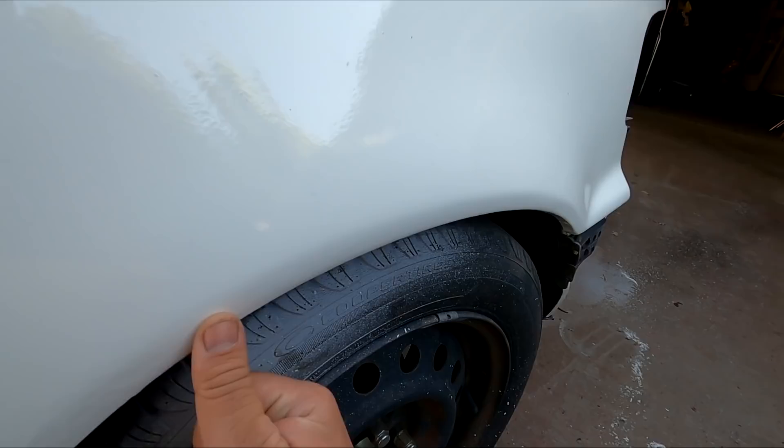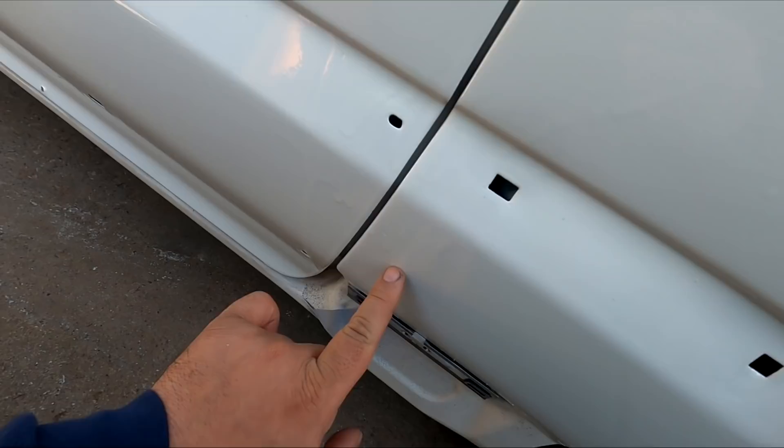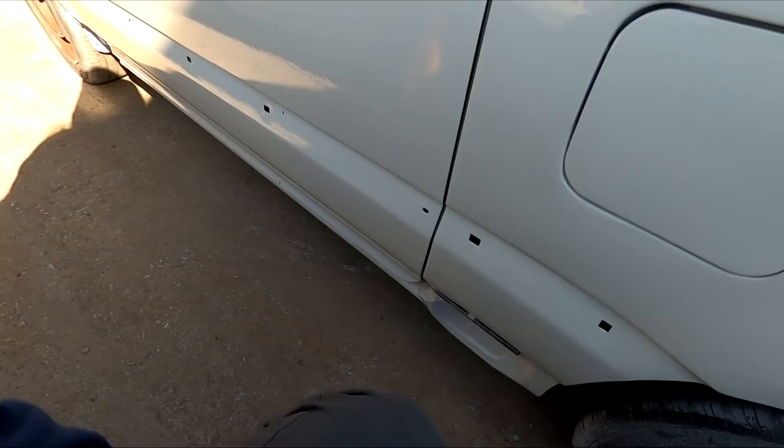But nonetheless, this can be blocked out no problem. Just got to stay away from the edge. We have a little bit right here still. And a new one that I saw just now is this clear coat run right there. These little two drips right here. It's smooth here, but two drips there. That can be blocked out. It's also at a lower point of the car. So it being blocked out and polished out, you're not going to notice it. I have a slight run right here. Very slightly. That can be blocked off really quickly. Not a big deal. And a little bit right there.